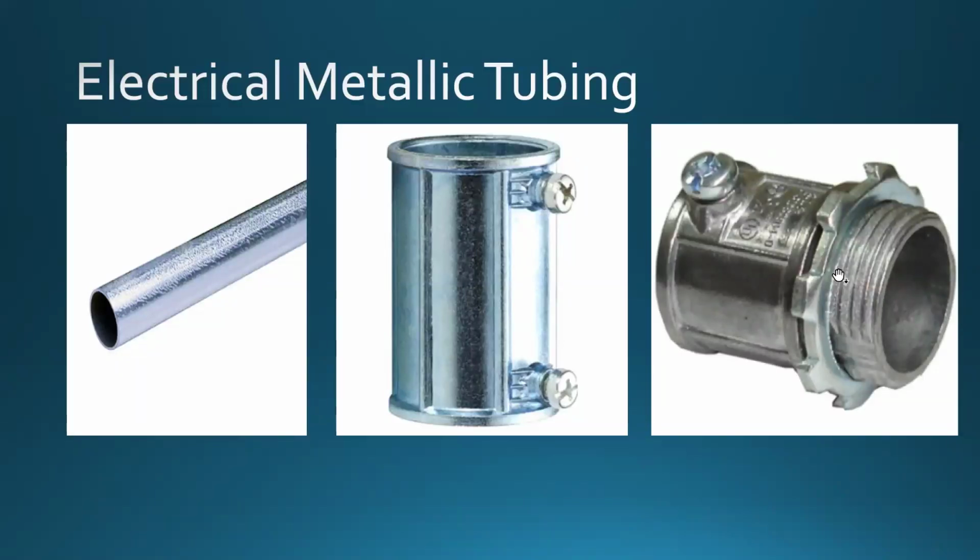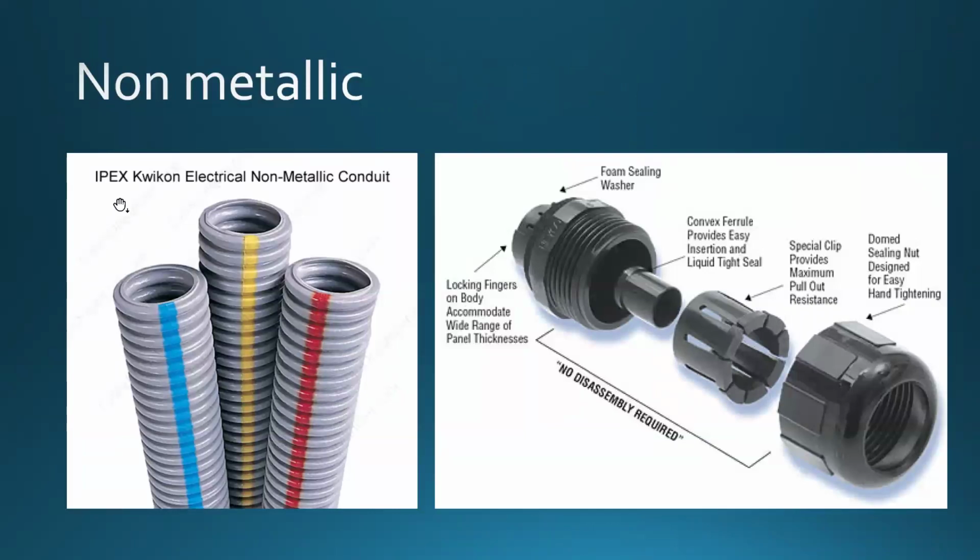Now, here's another connector. This is an EMT connector for the half-inch knockouts. There are other connectors that would accommodate the 3/4 inch knockout, and we have already played with some of the knockouts on the utility boxes that we did. So here's the EMT connector that accommodates the half-inch knockout on the box. Here's a coupler, and here is the EMT itself.